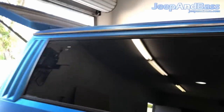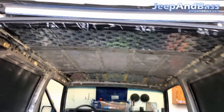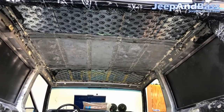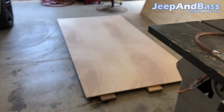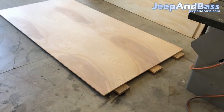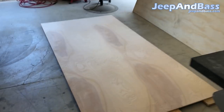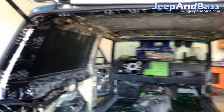What I'm going to do is make a sheet of half inch that fits the roof really well. I think if I measure it out it should measure out pretty square with some round corners. I got my sheet of half inch out here. A little trick I learned from Bobby Gately — lay your sheet out on some scraps and set your saw blade depth to where it just barely gets through the sheet. You can cut on the floor without too many issues because sheets are a little harder to handle on a small table saw. I'm going to leave it as one piece and try to install it as one piece, so that's going to involve some precise measuring, layout, test fitting.